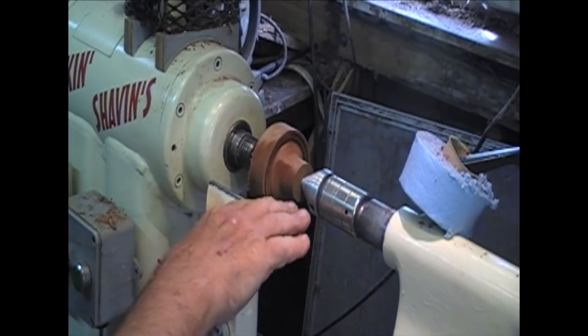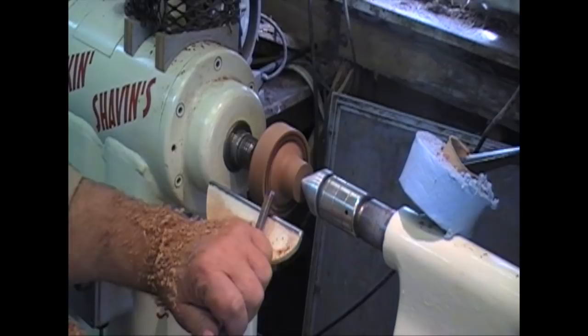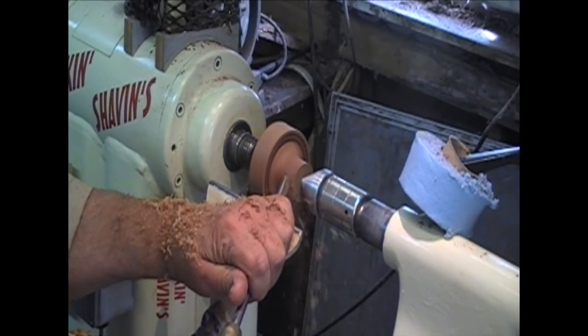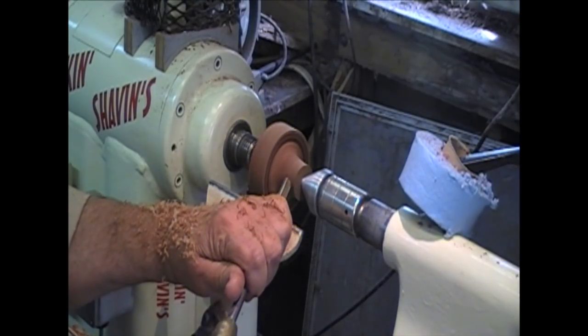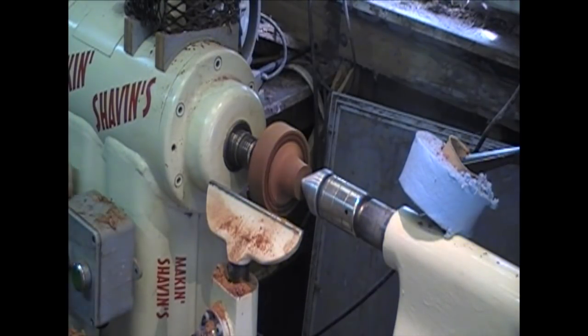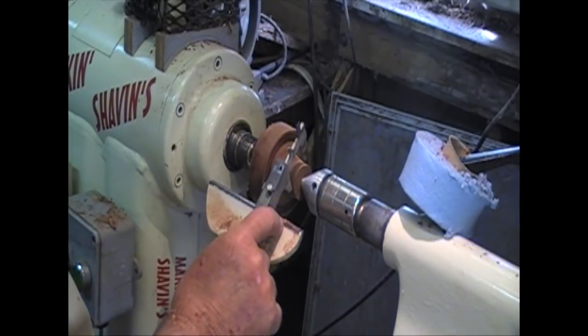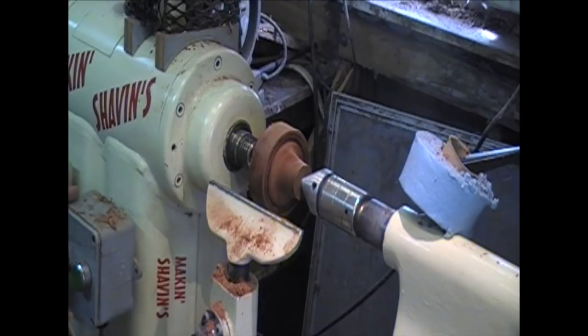Okay? And if you got a problem with sizing, start with little bitty rings at the bottom. I'll show you. Come on. Shields up. On purpose, I just cut this on a slope. You see the slope? See the slope right there? That's on purpose. So now I take my caliper or bowl gauge and go in and say, okay, I'm still a little bit large. I can get this done first and then check it in my faceplate. And if it's the right size, then I continue on and make it flat. You don't want it tapered. You want it flat. Shields up.